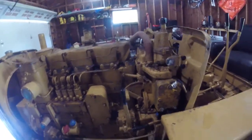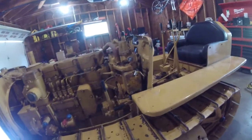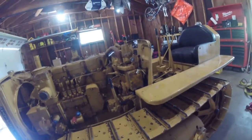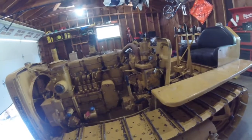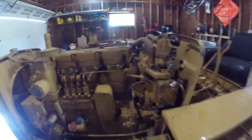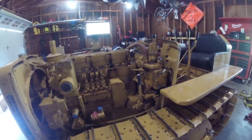It's going to involve splitting the tractor. As I mentioned before, we're going to try and make some sort of a stand to get the engine forward. And the reason I believe it's like this, I could tell from the handful of times I started, is those pinion governor levers want to kick out too soon, and it would appear as though the gentleman who owned this before me was just holding the lever up while he started until he wore that engagement out.